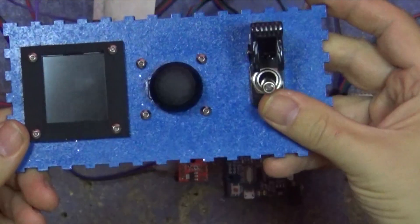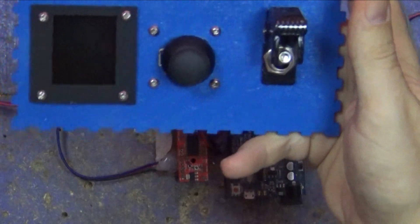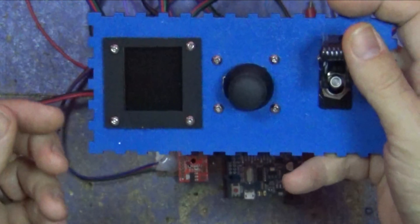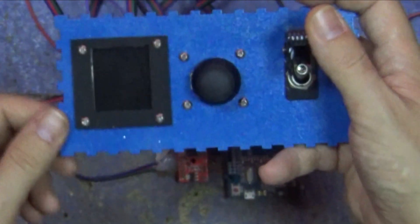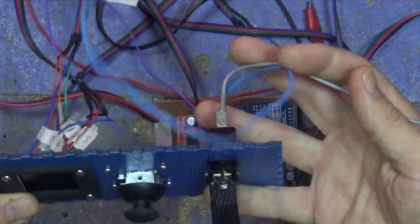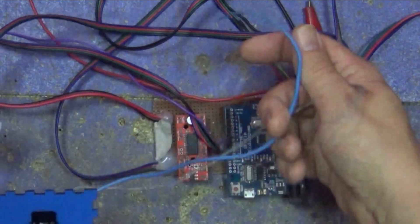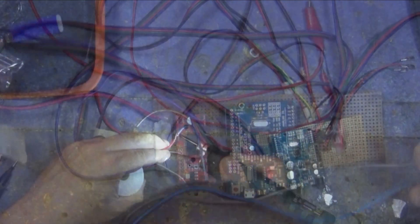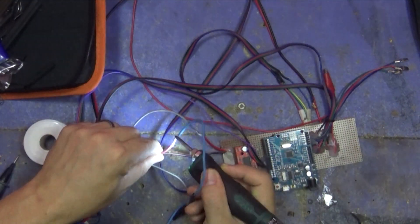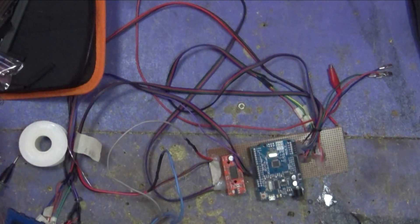With this type of switch there's an LED right at the tip, but I'm not using it. You can sand it down to make it more diffused, but it always ends up right in my eyes and I get coloured spots everywhere I go, so I'm not going to bother — I only need the two leads. I'm just going to cut the positive wire and splice this switch in between the two. Pretty simple.